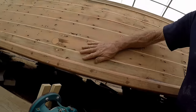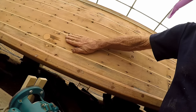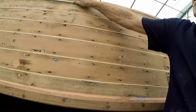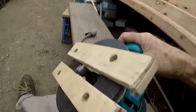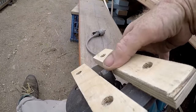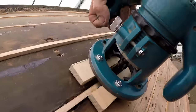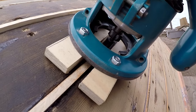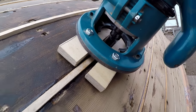I took these top three splines and faired the topsides a few episodes ago using my old wooden jack plane to take them off. Since doing the rest of the splines, I thought there's a lot of work there, so I've decided to use a router this time. I've got two blocks with a slot between them — the router blade is just level with the bottom of those blocks — so when I put it on the surface the router blade will cut right down to the level of the join in the planking, and there'll be hardly any left to take off afterwards.